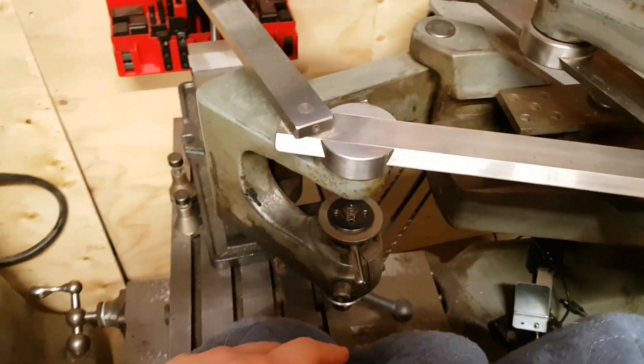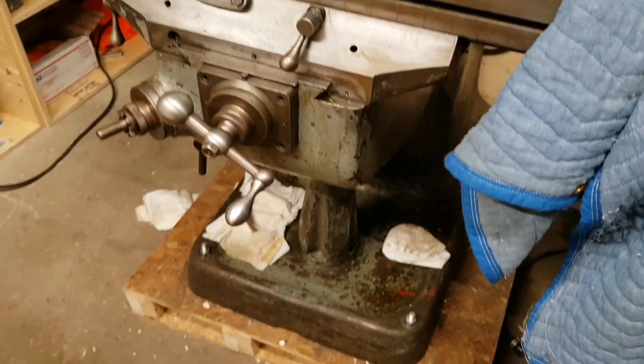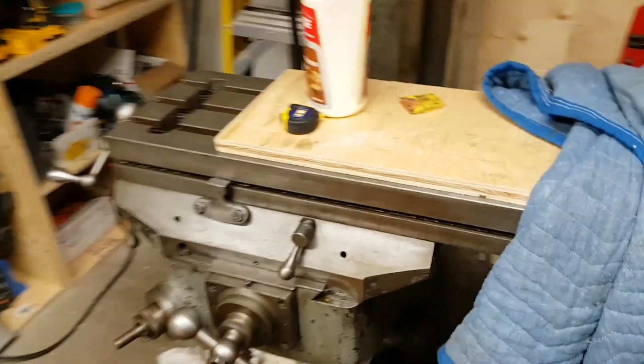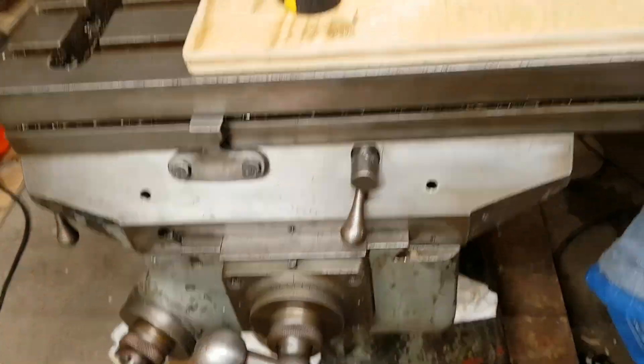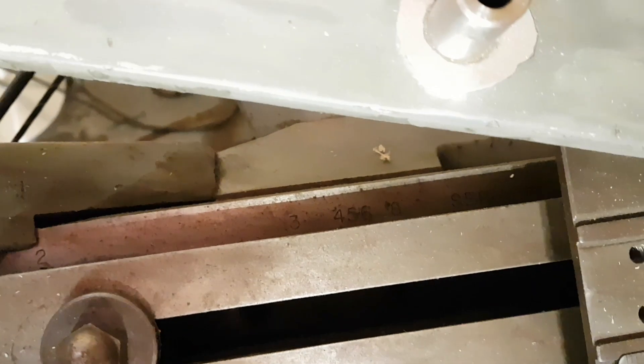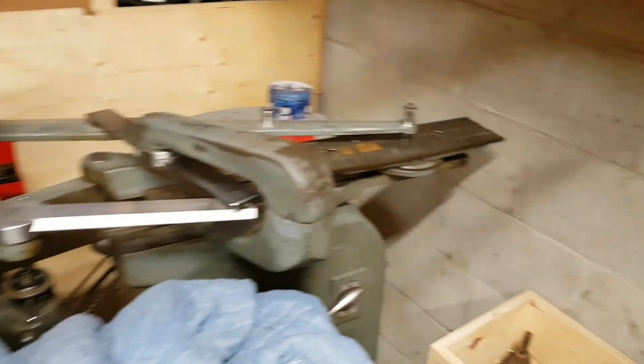The engraver — I've moved it into the corner here. This machine got so big that I started to take it apart and fix it. I cleaned it up, buffed it, got rid of as much grime as I could — I still need to do another day of degreasing. When I move the table all the way over, this machine is fully accessible — I have the vertical and XY there, and more table space. The pantograph has to change based on the scale, so I needed this breathing room behind it so the machine could actually trace a piece at that scale.